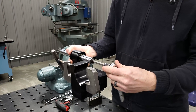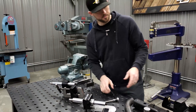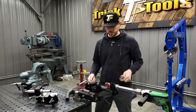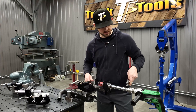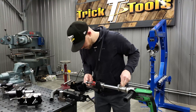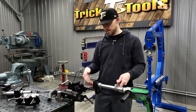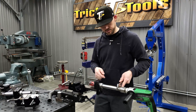Using that flat and an Allen wrench, you can tighten and loosen the set screw in place. For instance, after you get done notching, the hole saw is going to be in there pretty tight, so you can put a wrench on the shaft flat, put your Allen in there, and easily crack that loose to get your hole saw out — and also swap out the threaded insert.